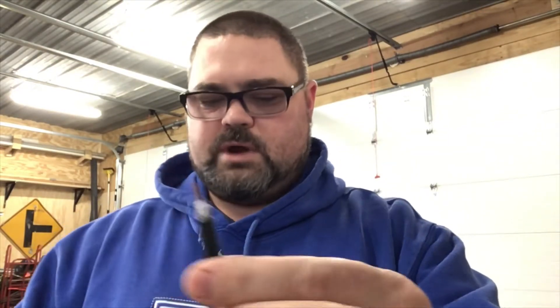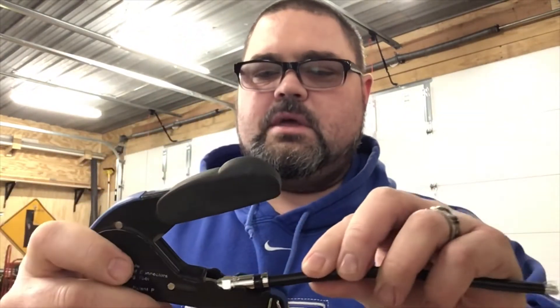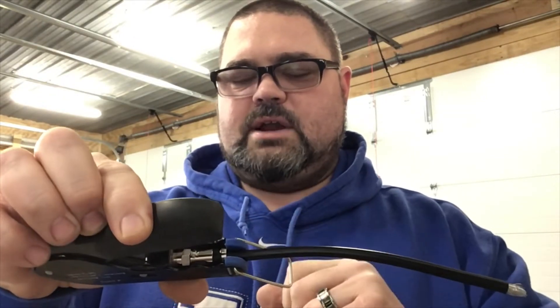You can hear it cutting through the wire and the protective coating. Once you pull it off, it looks something like that — you can see some wires sticking out. Now the nice thing is you take the new coax connector right here, slide it in and turn it a little bit as you put it in. I'm sure there's probably a lot of people who do it differently, but this is how I was taught. The center cable goes through just a little bit, and then there's another specialty tool where the coax cable fits in, the center fits down in here, you push it down, and when you pull this down it locks that connector on there.